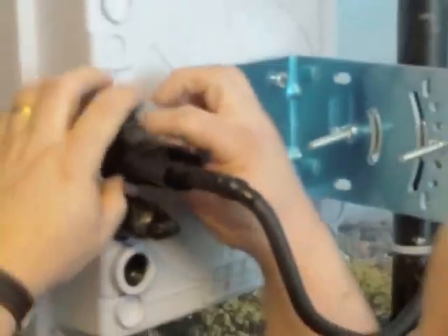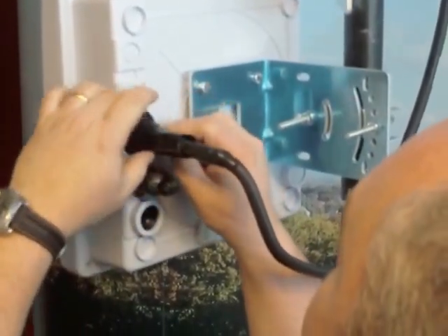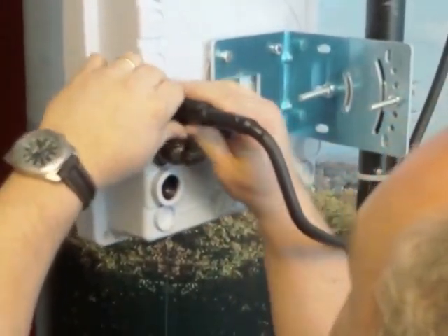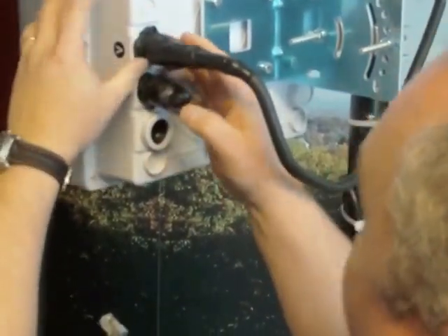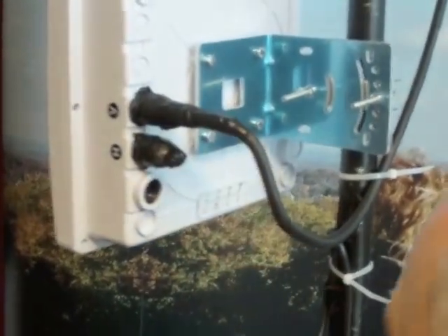Because it tends to stick, make sure you get your overlap on the radio and come up all the way around. Make sure it's all pressed together nicely with no gaps — nice and firm. Our two RF connectors are now properly weatherproof.